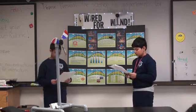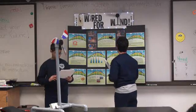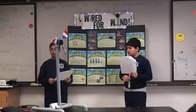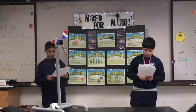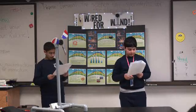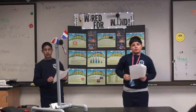For our experiment, we think the data we got did properly represent our experiment, because the highest amount of voltage closely resembled modern-day turbines. Future testing would involve recording wind speed and trying different sizes of blades. Our data showed that the greatest amount of voltage was produced with three plastic semicircle blades at 30 degrees.